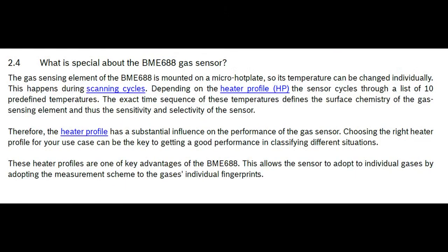So what's new with the 688? The way the gas sensor works, it's called a metal oxide semiconductor. There's an exposed oxide layer that reacts with gases in the environment — methane, alcohols, carbon dioxide, carbon monoxide, and so on. When it reacts with them, the resistance of that oxide layer changes. Oxide sensors are pretty much the only way we do solid-state sensing; they work well and are inexpensive, but there are variations from sensor to sensor, and temperature and humidity affect them. Having the temperature and humidity sensor in the BME680 is handy because you use that data to normalize the gas sensor data.